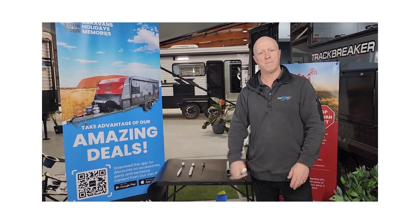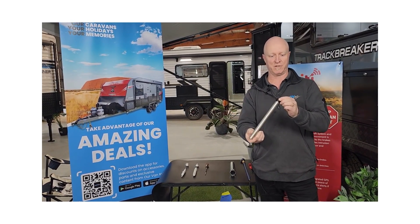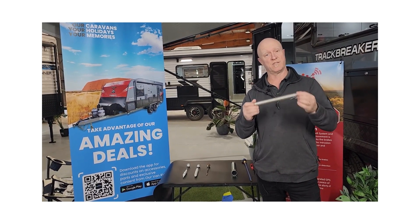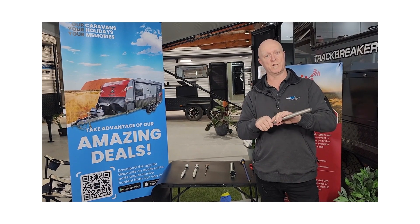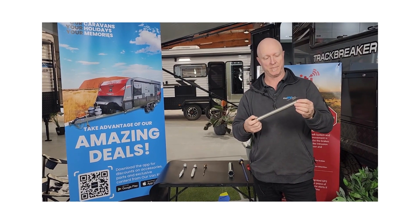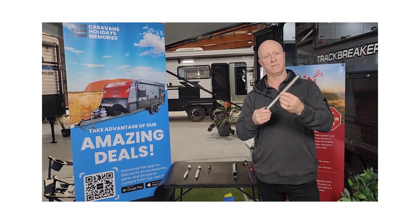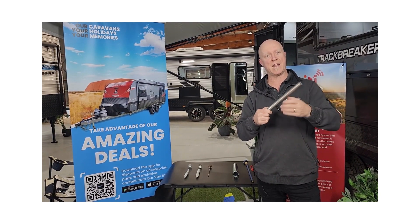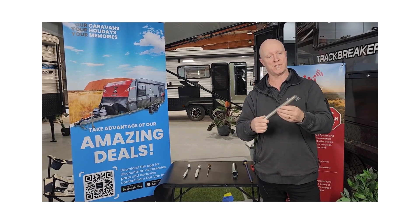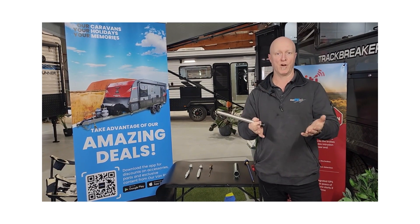Most people want to know: what is a sacrificial anode? Well, this is a magnesium sacrificial anode. It's made up of a sacrificial magnesium alloy and it's designed to go inside your hot water service, mainly suburban branded hot water services. There are a couple of others that need it, but it's only used on storage heaters. This anode material is designed to absorb any negative electrical energy that's going through the body of the caravan and into the body of the hot water service, and it's designed to let this material corrode instead of making the drum of the hot water service corrode.